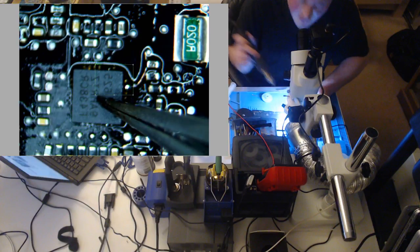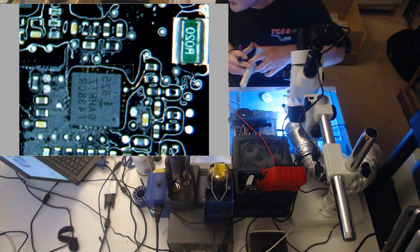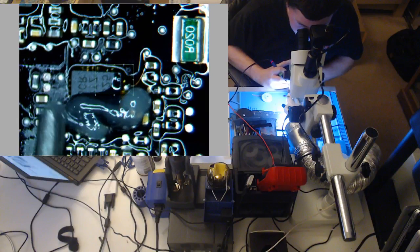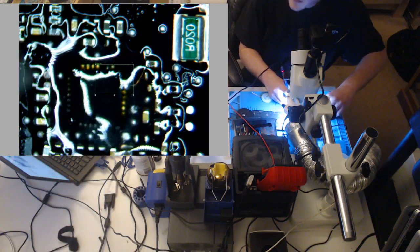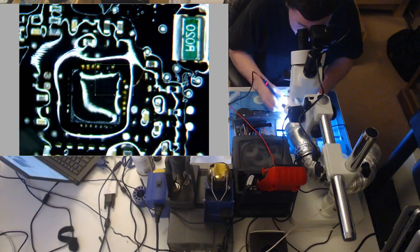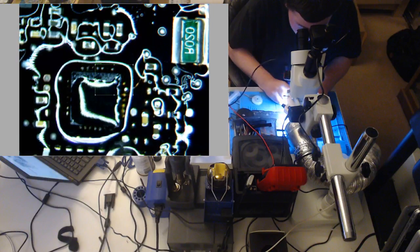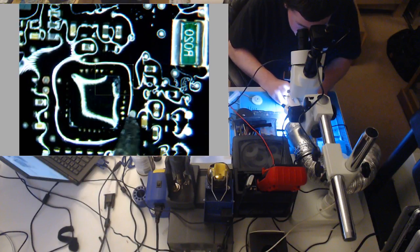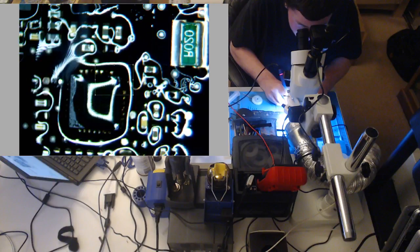Of course that happened. Not fun to shake me. Alright, any of you guys caught on to what just happened, you'd know why this one stopped. Because now we have a bridge. Right. Get out of there. Now we gotta fit back our jumper. But first we gotta check and make sure we're not bridged anywhere, because we have a very high probability now that we're bridged.